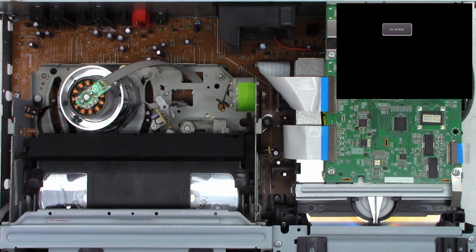Keeping in mind the flat side of the silk screen is the negative lead of the capacitor. And then I want to trim these leads with probably about a 1 millimeter gap. And because the leads on the board are a little farther apart than these are, I'm just going to bend it out very slightly and we'll get my orientation correct here.